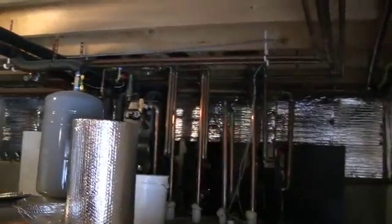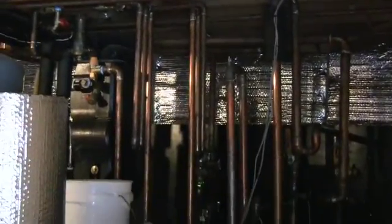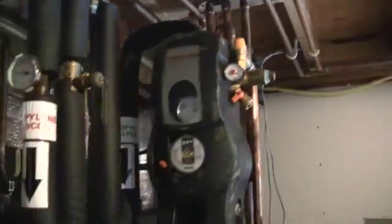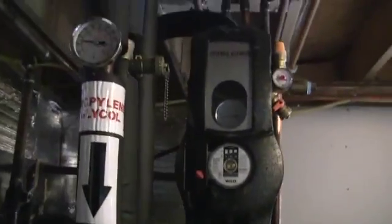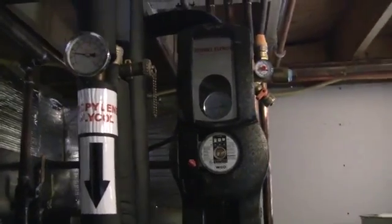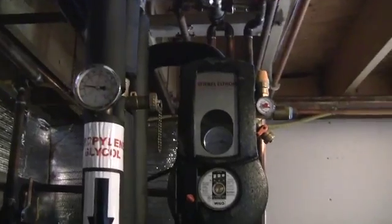You can see the coils entering it over here, where you've got the inputs for the solar hot water right here. The solar collectors are at 77 degrees — they're mostly covered in snow. So that'll help melt the snow, but they're not putting out any heat right now. But you can get heat out of these even in January and February when they're free of snow and there's sun shining.